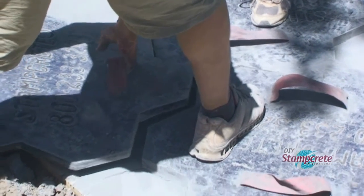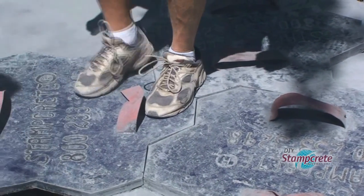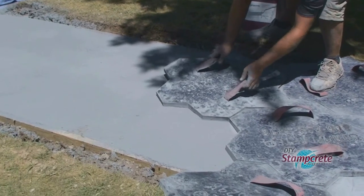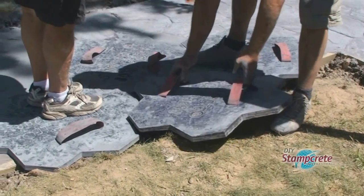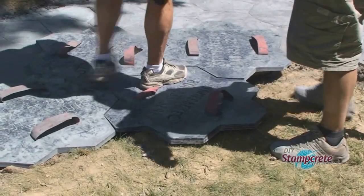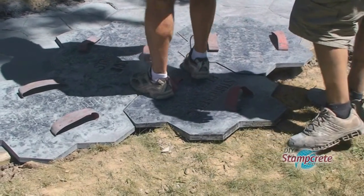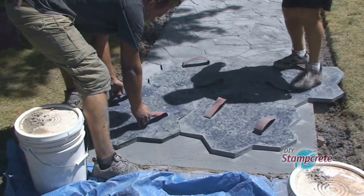It's important to know that if you don't get a stamp placed correctly, don't panic and don't pick it up and try to place it again once it's down on the concrete. That's important advice because that will result in a double impression. Instead, keep going. The Fieldstone surface is forgiving, and the 2 small texture stamps and the roller tool will work well to touch up any mistakes.